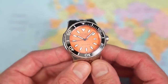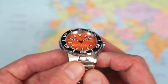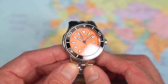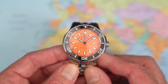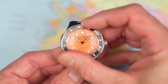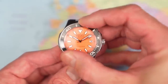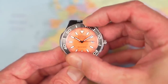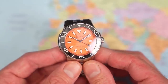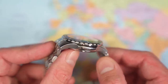Nice and slim — under 12.5mm — and yet retaining 300 meters of water resistance. That is a piece of very mildly double-domed sapphire crystal with anti-reflective undercoating — maybe just a slightly bluey-purple tinge to it. Ceramic bezel insert. The bezel is 120-click, unidirectional, and it's really, really quite nice. Everything lines up as it should. The bezel insert itself looks like an off-the-shelf item, but it goes with the watch overall, and it's pumped full of lume as I'll show you in a minute.